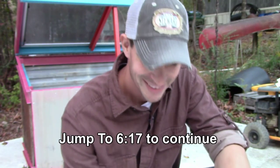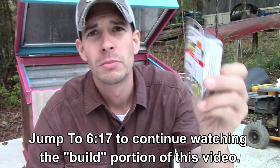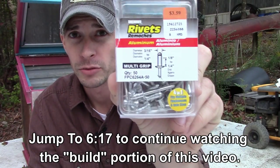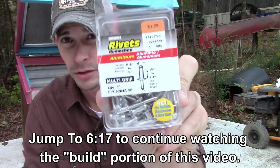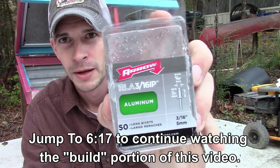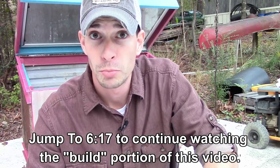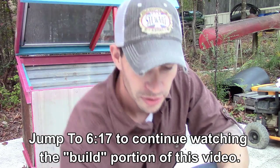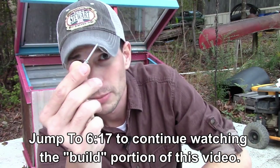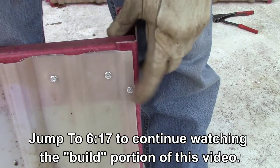Here's what I have to say about rivets — there's definitely a difference in quality. I purchased these rivets from the local hardware store up here. It's not a big name brand, but this rivet is a hell of a lot better quality than this other rivet. I'm not going to name any names, but this rivet doesn't always break off inside the head like it should. Sometimes they break off up here, so you've got to go back and cut them off. Think about that when you're looking at different brands of rivets.